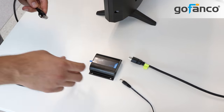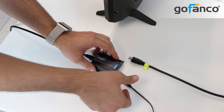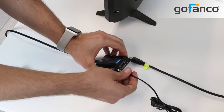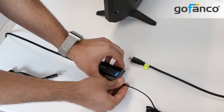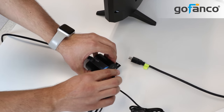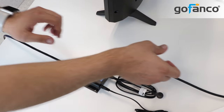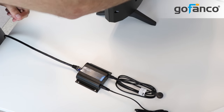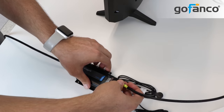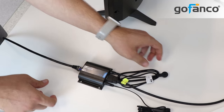The other side of the 130-foot CAT6 cable will go into one of the receivers. A power adapter will go into the receiver also. Then we have another IR cable so we can control the TV from the display side. And then we have an HDMI cable out from the display and into the receiver.